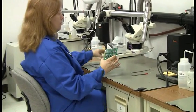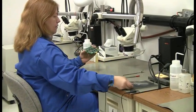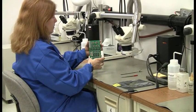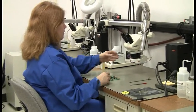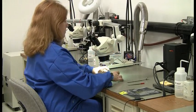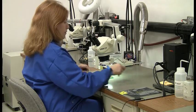She's got her wrist strap on, heel strap on. You can see a lot of different style components, and as technology progresses, the parts are going to get smaller and smaller, and they're going to become more and more ESD sensitive. So what we just showed you in this short video — what to wear and utilize during a rework process — is what you should do. Thank you and have a nice day.